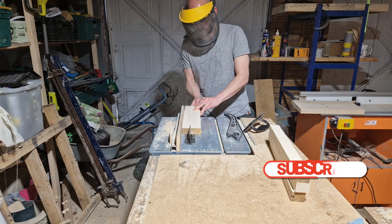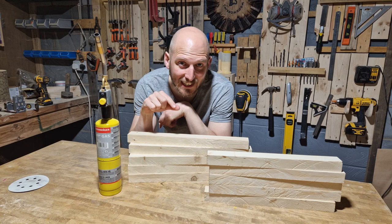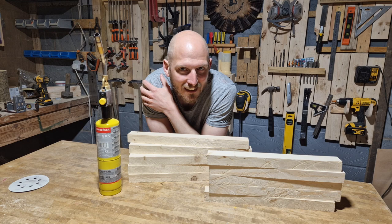I know what I'm going to be using for the draughts pieces, and I'm making the squares slightly bigger than those pieces. So now I've got all my strips cut, here's my plan. The reason I pre-sanded this is because in theory, if I burn half of these, glue them in strips, then re-saw them and glue them again, it should create a checkerboard pattern.